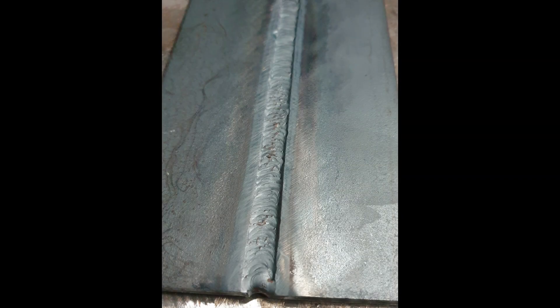We are using the weave technique where we add wire to both sides as we are moving the torch from left to right, and the wire always follows the weld pool. We have to dip both sides to ensure that we've got sufficient metal going into our weld pool, and our dips must be consistent so we can keep our weld smooth and the welding profile flat throughout. If this has been done correctly you will have a flat profile where you can see both edges.